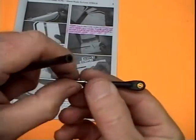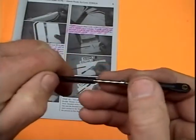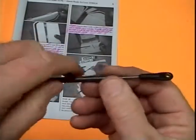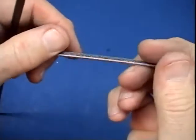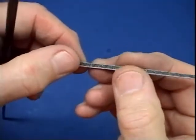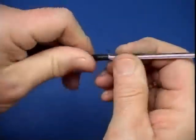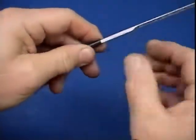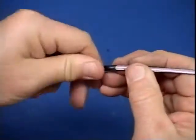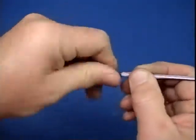I'll get the JB Weld mixed up. This needs to be sanded. Get in there and sand it good, put it in, give that a couple hours to dry. Now our good friend Bernie Trent gave us these little sanding sticks, which look just about perfect to get in there. Grind away some of that material. In fact, if I just get this off one side, the rest will go right in. You need to scratch that up.